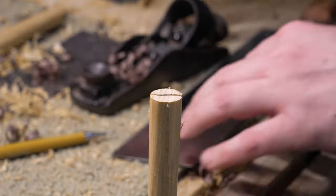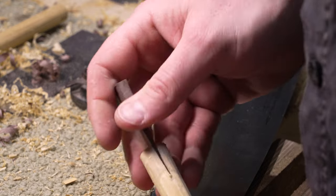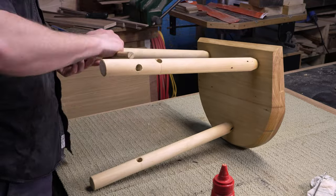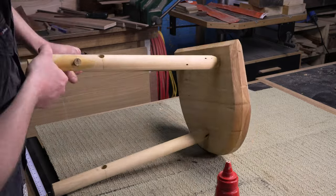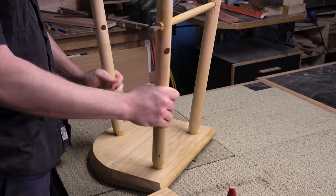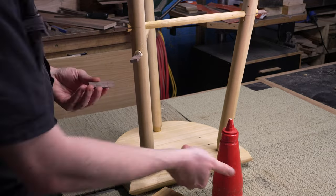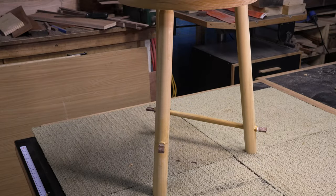Just cutting a slot for the wedge. I was just surprised at myself that I managed to drill those holes without too many issues. They're not perfect, but no one's gonna know — except for me and you. Again, just gluing one side of the wedge only because I read it in a book once. Note the direction of those wedges — if they were turned 90 degrees, as you hammered them in, the grain might split running up the leg.